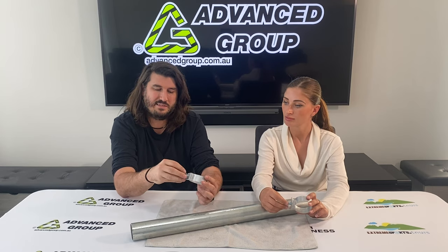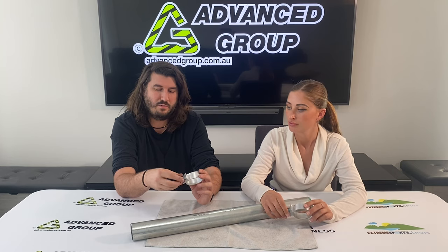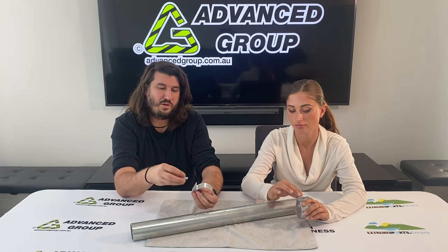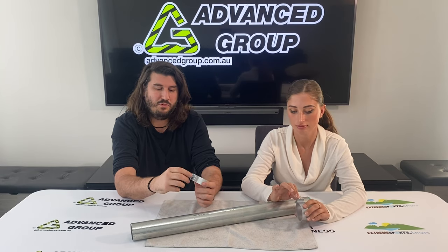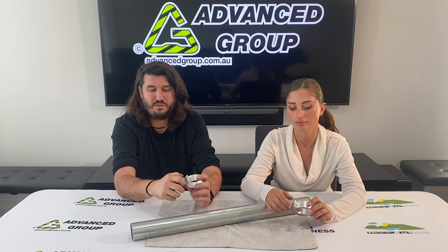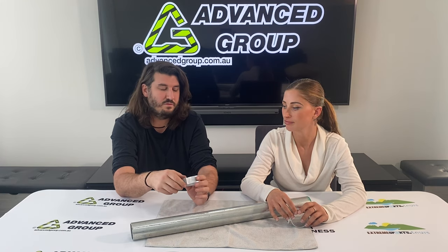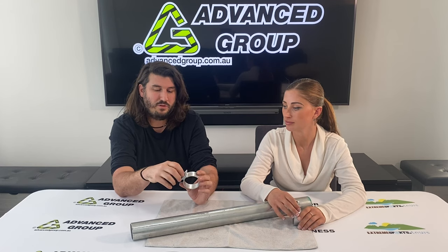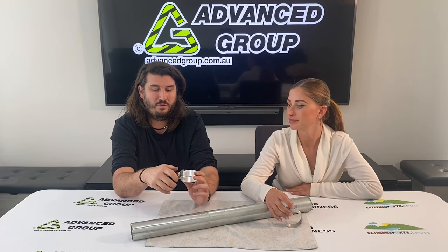They'll sometimes rust bayside. However, the negatives of having a hot dip gal bolt outweigh the benefits, considering most signs are bayside. If you're using a parking sign at the beach, it'll probably be there for 20 years, so if you have to cut it off once every 20 years because it's rusted on, then so be it. The zinc would normally last 20 to 50 years away from the ocean. Maybe at the ocean it might start rusting after 5 to 10 years — it doesn't completely rust off, it just binds on so well you find it difficult to get off without angle grinding it. You just start it with your fingers and then tension it with a socket set or an impact wrench, or a drill attachment.